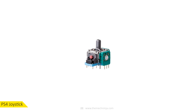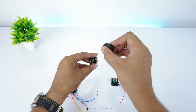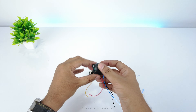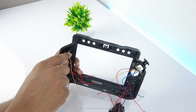For the main controls, I'll be using PS4 analog joystick modules. They offer excellent potentiometers and high accuracy, perfect for drones. They don't come with a PCB or top lever, so I mounted them on a custom 3D printed plate and reused levers from cheap joysticks. Everything locks in with M2.5 screws. Once installed, the transmitter finally starts looking real.